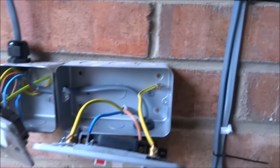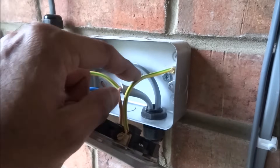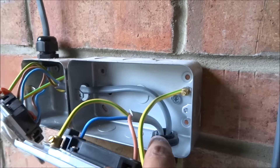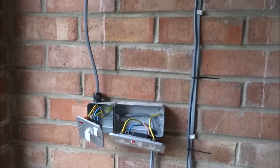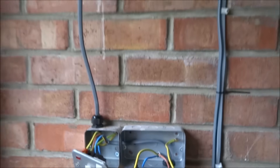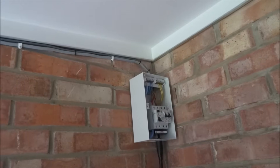I didn't want to replace the existing sockets or the light switch — they're fine. There was a hole here for the power previously so I've put a gland there and fed both cables through: the lighting circuit cable and the 2.5mm socket cable. I've wired it up and connected everything. I also fitted a gland here to make it tighter, pushed some cable back up, and secured everything with the remaining clips. Cable ties have all been tidied up with excess cut off.